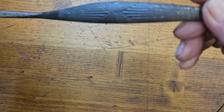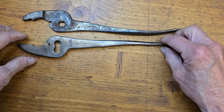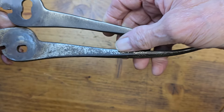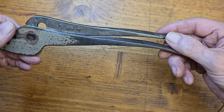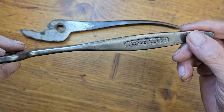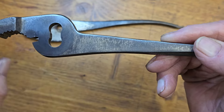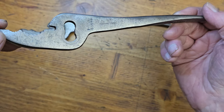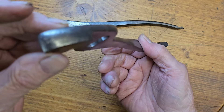This is half of the pliers to show you what I started with — it was pretty bad. And after a good bit of wire brushing, we're here. So you can see a big improvement so far. Here's a good side-by-side to get a look at them. These were really, really in need of some work. The thing about it is, while wire brushing cleans up a lot, it uncovers a lot too — stuff that needs to be done. If you look close, there was either a chrome or a nickel plating on here that is still on in spots and needs to come off. So the other way to get that off is going to be through sanding. We did a good initial cleanup with the wire brushing, but it's going to need a lot more work.